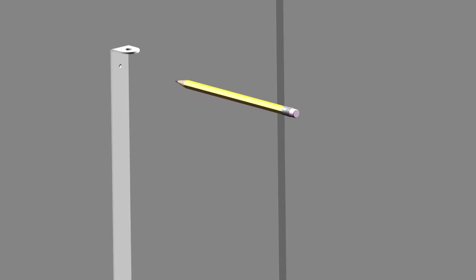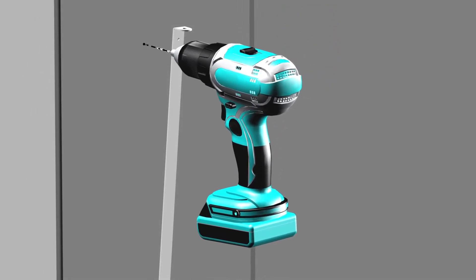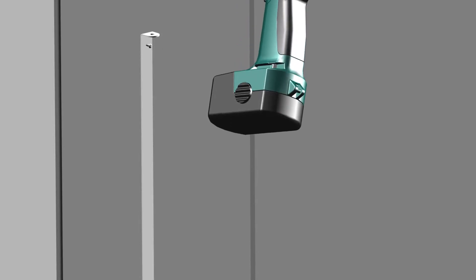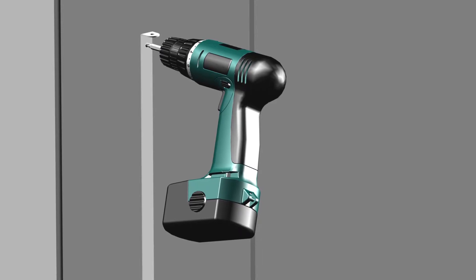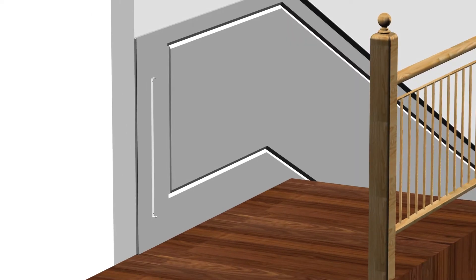Use a pencil to mark the location of the top hole. Next, grab the hinge bracket and pivot it out of the way to the side. Using a drill with a 1/8 inch diameter drill bit, drill a small pilot hole. Pivot the bracket back into position, matching the top drilled hole. Insert the Phillips screw Part C into the hole to secure the hinge bracket, and tighten the screw using the screwdriver. Step 1 is now complete.